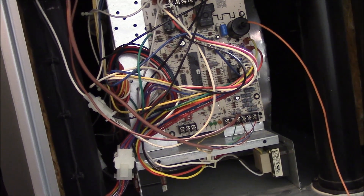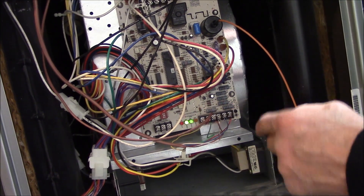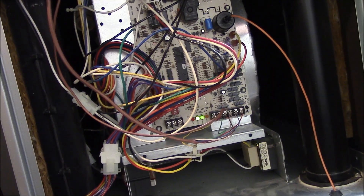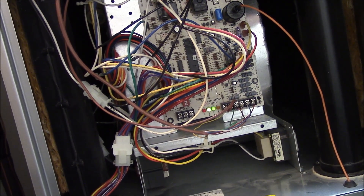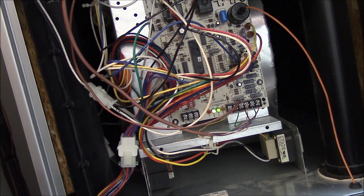I'm going to hit the safety door switch. The first light is power, the second light is status — that is going to be what flashes and gives you your error codes, and the last light is the flame sensor. Right now the furnace is powering up.